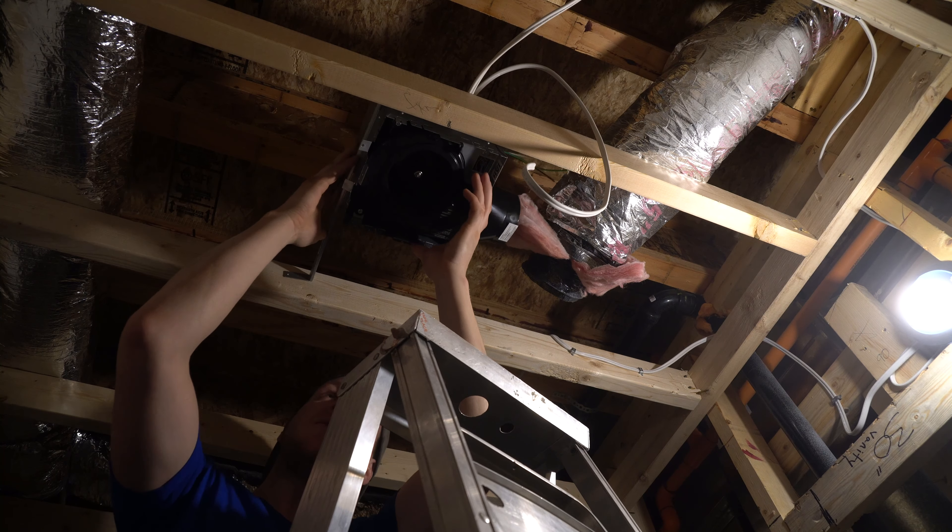Now that we've got that, this will go here, this will go here — suck that end up, perfect. If you're looking at your box, you'll notice this piece. But if you're going right up against the stud, that's too long. So we need to cut one of these links out. You can either try the bendy method, or if you have a pair of tin snips we'll just try and cut this out.